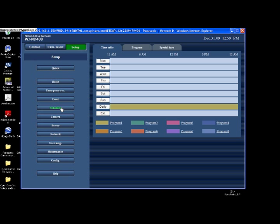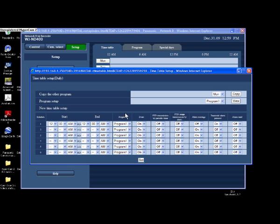Now we're telling the recorder to accept alarms coming from the camera. Under Schedule — the next place we want to go — we're just using one scheduled program. Program one is the active program, running daily, every single day, 24 hours. You can see the time across the top. I want to look at the time that's been set up because we can turn this alarm protocol off at different times of the day if we don't want to accept these alarms.